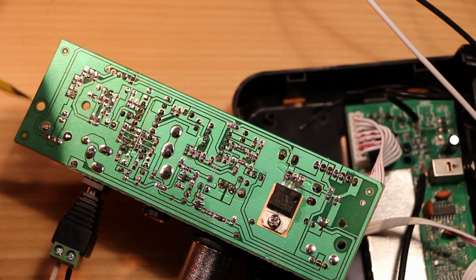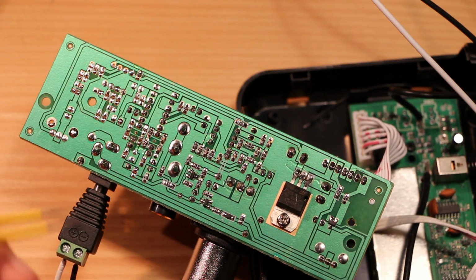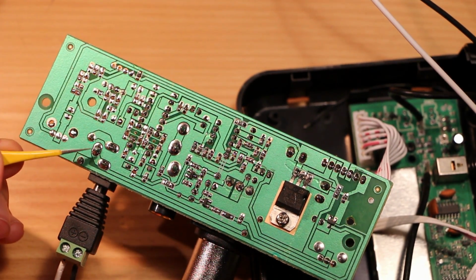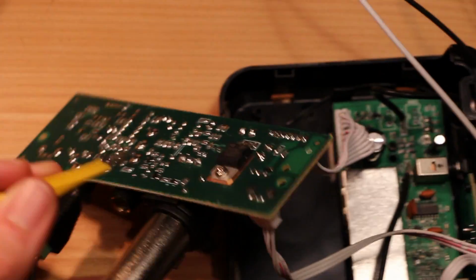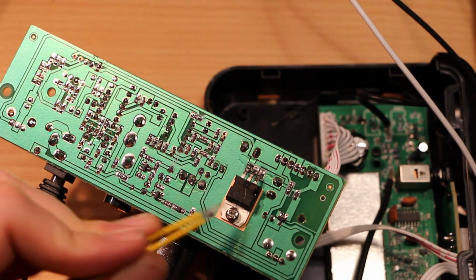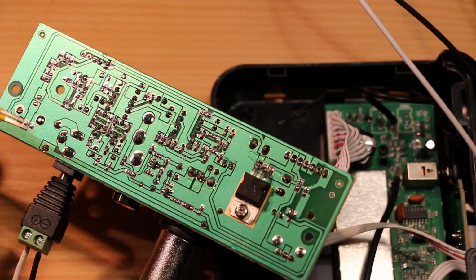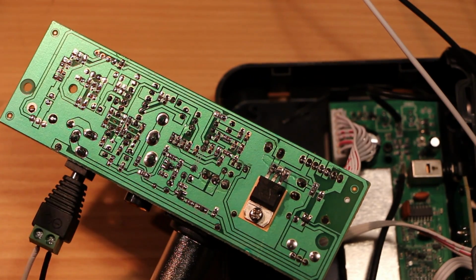These two large devices on the inputs and outputs of this 7809 are those big 1000 microfarad caps from earlier. Either this fill over here isn't ground, or maybe they just wanted to isolate this current return path. But it's interesting, the DC minus over here kind of snakes through, and then there's a jumper. Where's that go? It jumps right there, and then that's the ground for the regulator. Maybe this is an accident, but I'm going to give them the benefit of the doubt and assume that they did this on purpose.